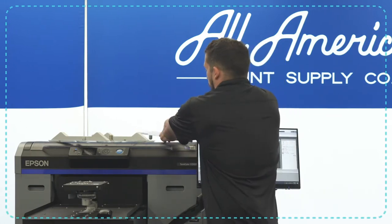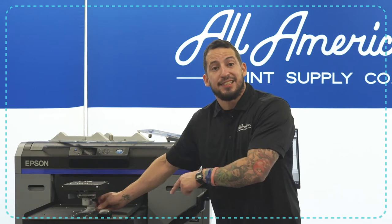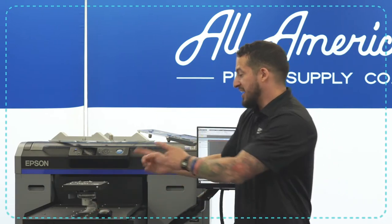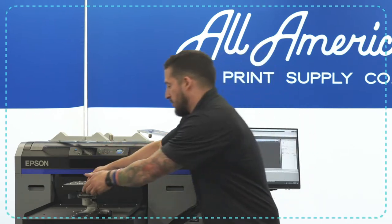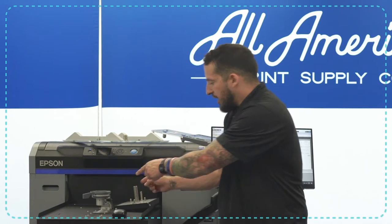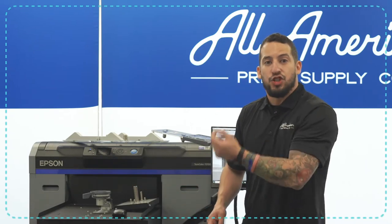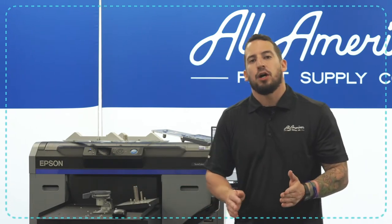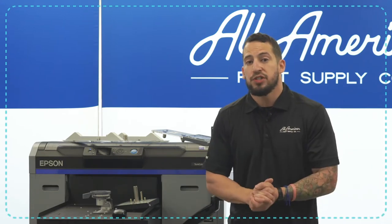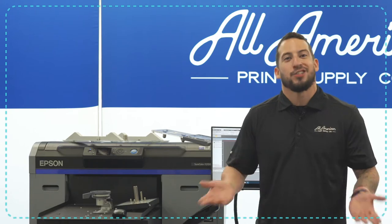What we're going to do first is release this lever, which we usually do to lock in our platen height, and that's going to allow me to take off the entire mounting adapter. So we're just going to lift this up just like so. Next, we're going to take off our platen height adjuster. This is the knob that allows us to toggle between the print setting, lower it down to about a 1, 1.5 for t-shirt printing, and so on and so forth for our various options.